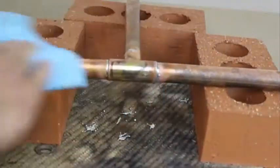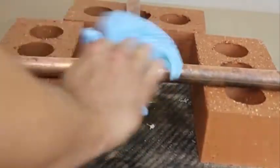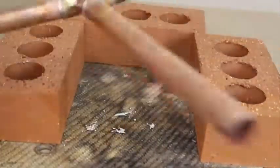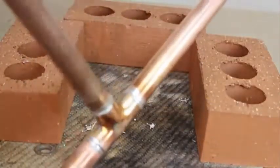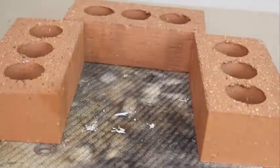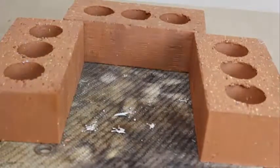Now, depending on what size pipe you're using — if you're using 15mm pipe, it's not going to take as long to cool down. Whereas if you're using 22mm pipe or something a bit larger, then it's going to take you a little bit longer than the smaller pipe. So make sure you don't burn yourself when you do this. And just with a damp cloth, wipe away the remaining flux so the pipe doesn't corrode and turn green over time.